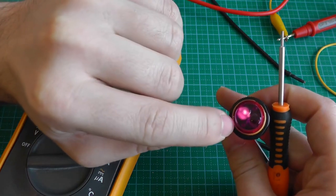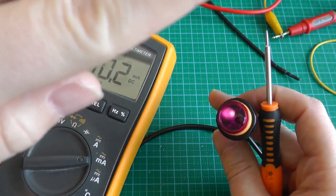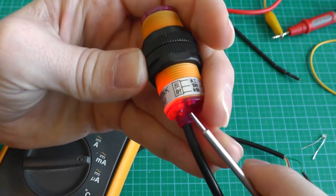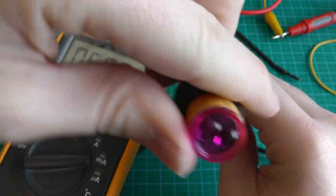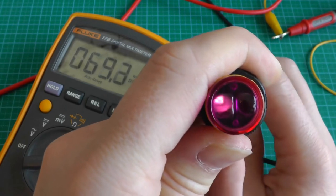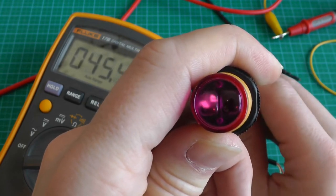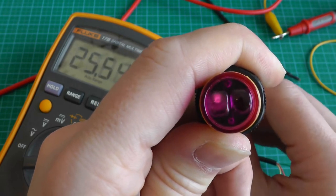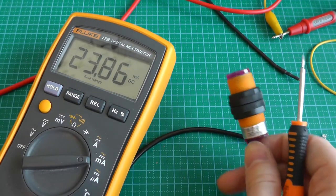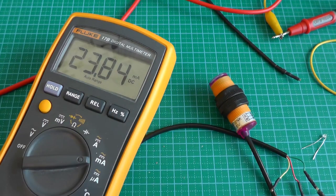The reflection can reach a bit further and the demodulator is fixed. Let's see if we can see the LED on the camera before I dim it back. So here I dim it — I turn it, and you can see on the camera that the LED is fading slowly. So this is a problem. I have to find another alternative, because I want to operate my end device with batteries, and I cannot have an LED at 25 or 30 milliampere constantly on.